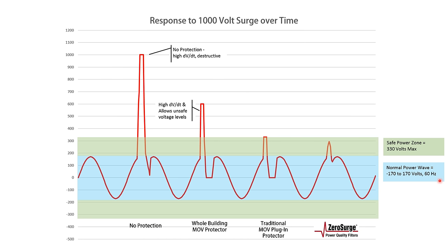The second surge also has a very high voltage rise until that MOV engages, for which most whole-building surge protectors engage at 600 volts or higher. During the surge, the MOV diverts most of the surge energy to the ground and thus interrupts power for that brief time, which is represented by the dip. This device allows for unsafe levels of surge energy to reach your sensitive electronics before engaging their protection.